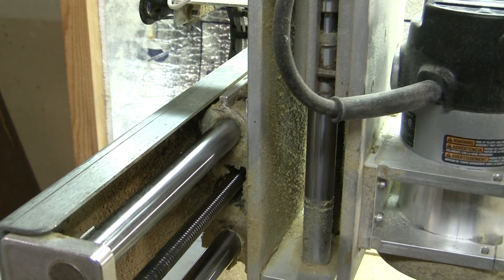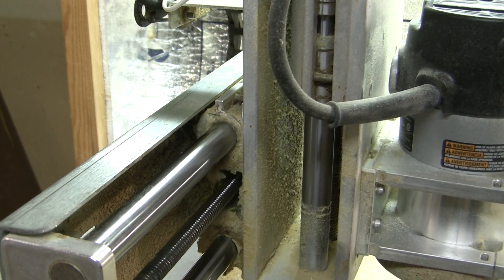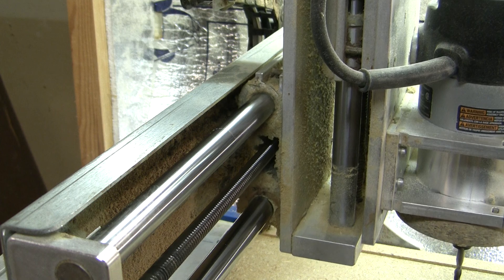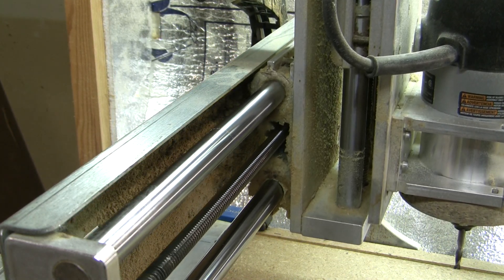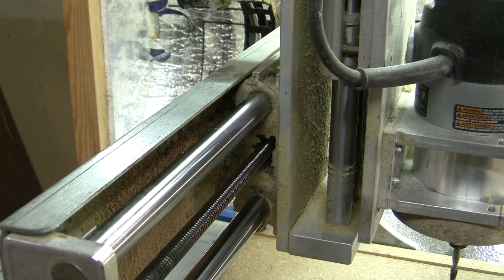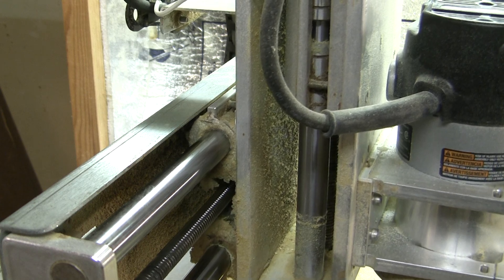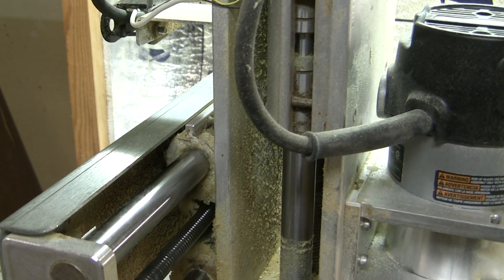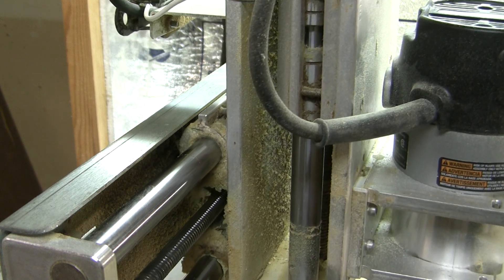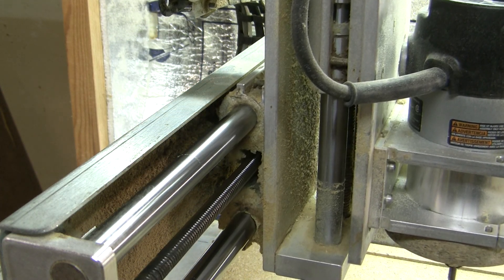It seems I'm having a bit of a problem with my Y direction on my gantry. It cuts a piece out, cuts another piece out — three layers, cuts another piece out, three passes. But when it got down to the third pass and got to a certain point, it ceased moving properly and thought it had finished the cut, so now it's off zero.